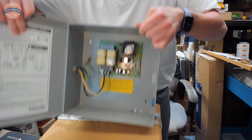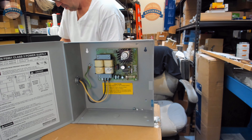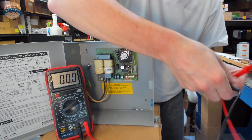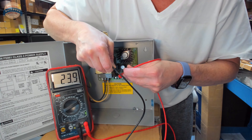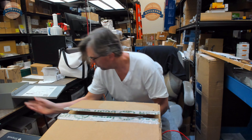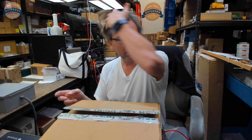I'm putting the jumper back in and plugging it back in. Still set on DC voltage — I'm going to make sure I'm getting 24 volts now. 24 volts. We've established that we have voltage working on a PS861. Now I'm going to move that cord over to the PS873 that we want to test, because that's what the client called about — no output voltage. Let's help them determine why.